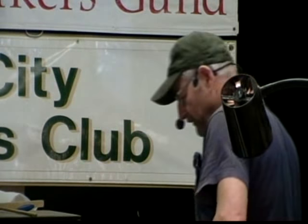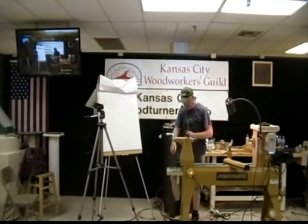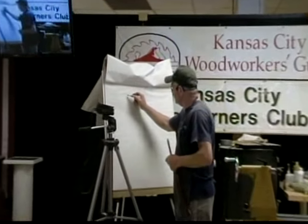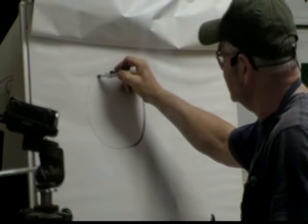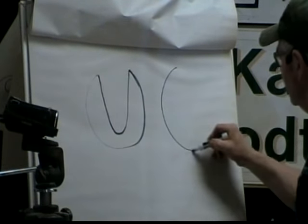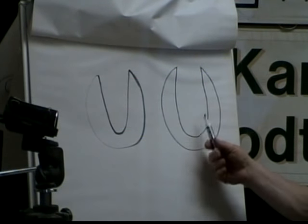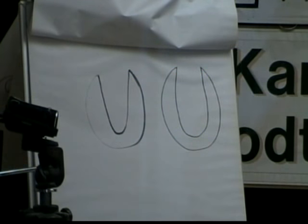when I'm buying one, I'm more concerned with the shape of the groove, because I'm making the Irish grind. And the Irish grind requires a little bit of thought. Just get one of these guys. There's two basic kinds of flute. There's that shape, and there's this shape. See the difference? That makes the best Irish grind. And the best shape that I've seen is the one with the black handle, the Pro-Am.